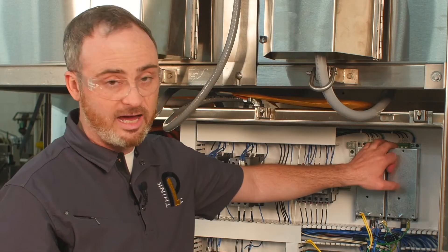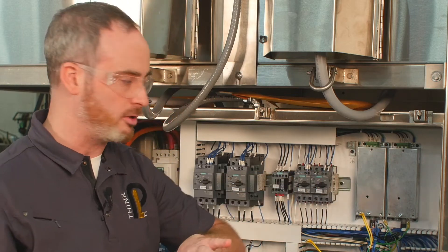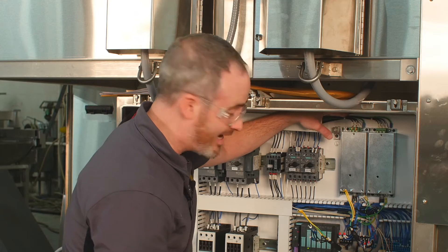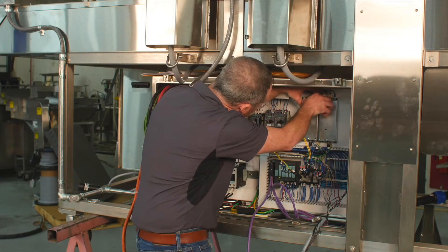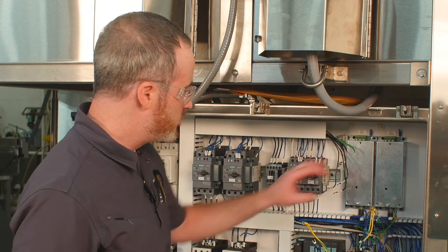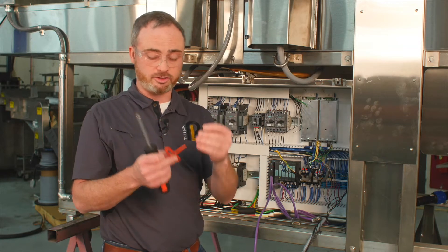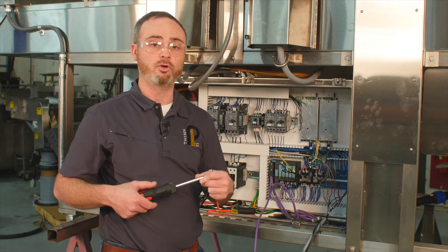Remove lines 24L1, L2, and L3, and 25L1, L2, and L3, along with the ground wire. Take off the EMC filter and prepare to put the new drives in, pulling those wires back and getting them ready for the bottom side of the new G120. Any zip ties in your way holding connectors to the back panel — discard them with snips. On removal of the EMC filters you'll find button-head 8-32 standard screws; a 3/32 Allen T-handle or standard Allen key works great, along with a Torx bit in a screwdriver to remove those hard-to-pull screws.